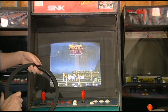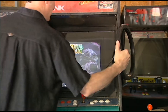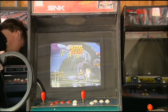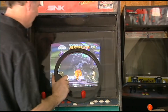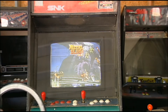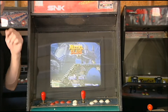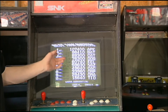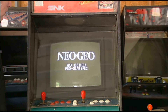Let's degauss the front and sides and back away before you turn it off. The purity looks really good here now. I'm going to go ahead and pull this chassis out and install the sync modification to see if that takes care of that curl at the top.